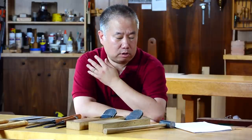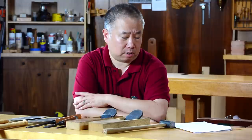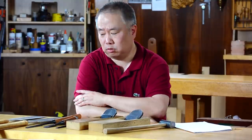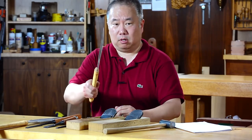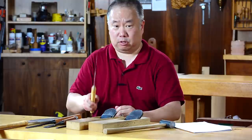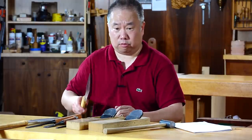If you're already good with a Western saw, there's really no reason to switch to Japanese saws. But if you're a beginner with hand saws, or if you're trying Western saws and having trouble, then Japanese saws might be the thing for you. In terms of body mechanics, it's pretty much the same as using Western saws — keep the saw moving back and forth, try not to put any downward pressure on the saw, and let the saw do the work as you go through the cut.